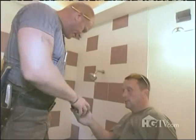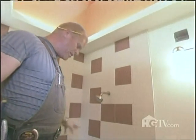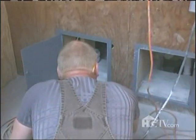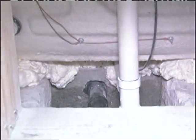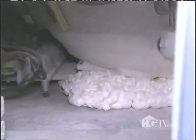Get a drop cloth on there. A drop cloth. Take a look at the foam from the outside? Sure, but we will put in a drop cloth and some heavy sandbags. That'll do. Okay. Either that or water. The foam's perfect. It's nicely sealed under the tub. It'll continue to slightly expand, bond to the tub, and bond to the concrete.